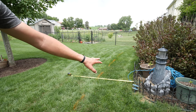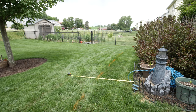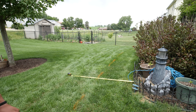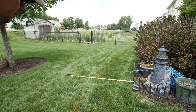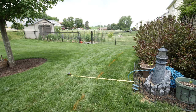With the mapping I'm doing, I'm just taking some landmarks I know aren't going to change — like the edge of this landscaping here — marking out to where the line is for the water, and putting that on a map. Taking some photos, taking some video, and making sure I know where those lines are. Once everything gets filled in and repaired in the next month or two, you really won't know where those lines are anymore. So in case I ever need to fix anything, I'll have a map of where everything is and I won't have to go digging around.